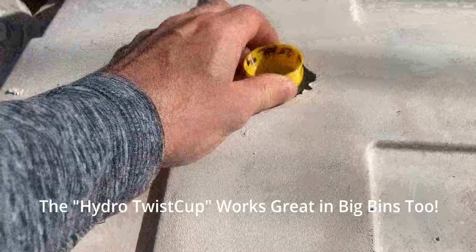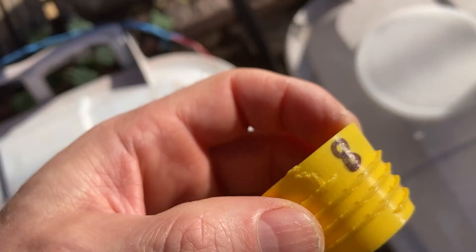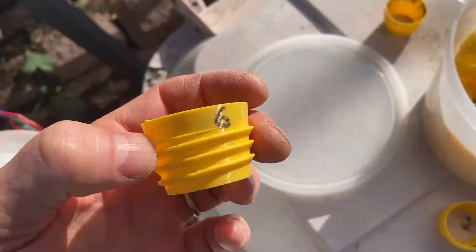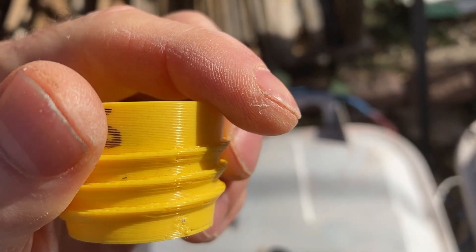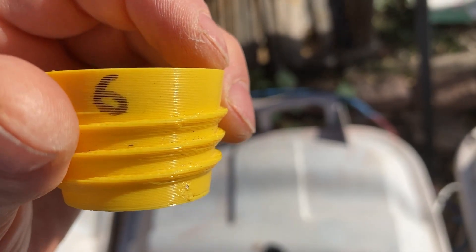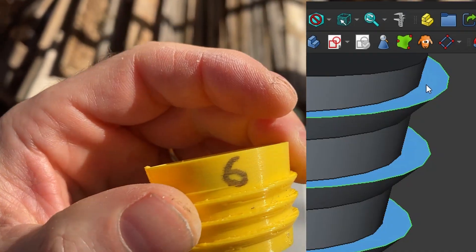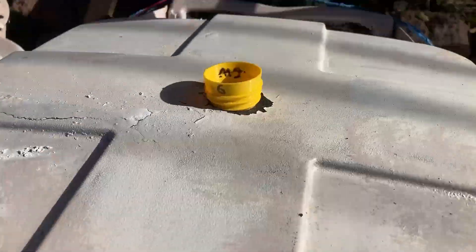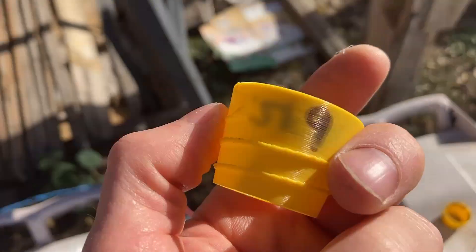Let's just pull — see, that's just not going anywhere. So that's v8, with a nice thick thread. Let's try v6. Remember how these are formed: the thread instead of being a 45-degree angle is coming up from the bottom at 45 degrees and then going across to join up to the cup on top at 90 degrees. So you've got a flat lip on top — I filed off the ends so it wouldn't be sharp on your fingers. Let's put v6 in — it's good, it's not going anywhere. They're all pretty similar. Now let's try one of those version 9s with very tiny threads.